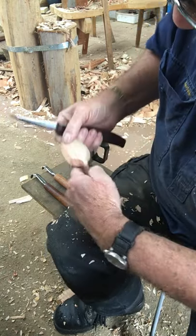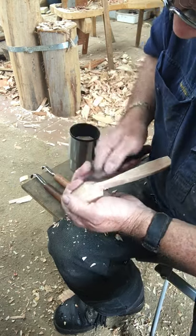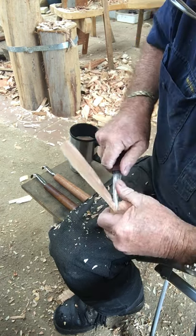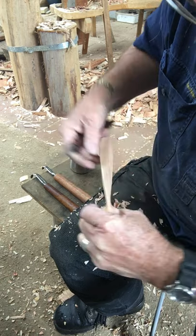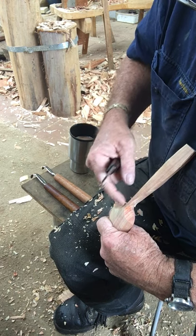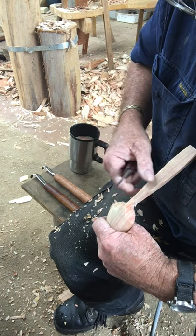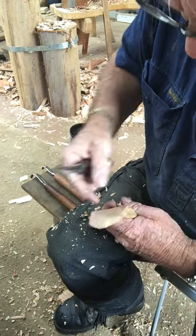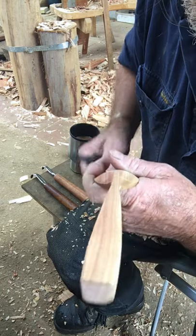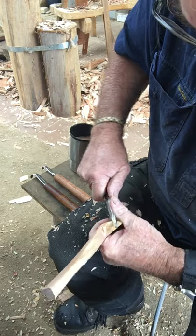But if you're going to do a facet, you can see that they're nowhere near mirror image. This one's got to come over into the middle there, so we'll do that. That one's got to go up there. So we'll do that, and look, center line here, running down. Use the grain to guide you, if it's not too wonky. Okay. Look down this side. This side's a lot deeper than that side already, you can see. So we'll take a bit more out of there.